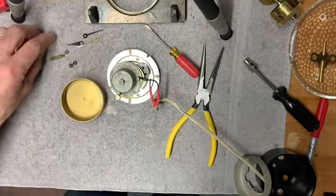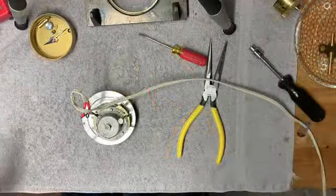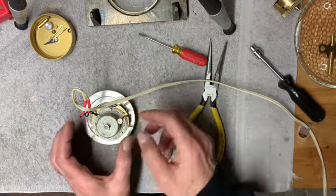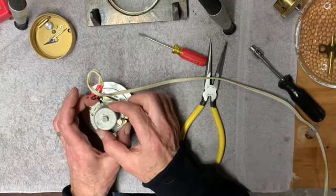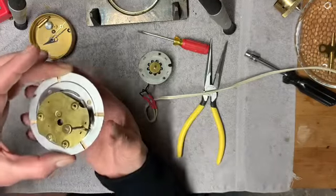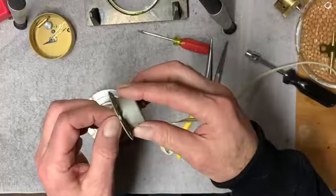Let me gather these pieces up here so nothing gets lost. I've taken a lot of photos and I think I know the positioning of the gears. It also looks as if I can hold down this brass plate — I should be able to remove the motor without disturbing anything underneath it. Let's try that. This plate looks like it's going to lift right up from over the gears, so let me take a closer look before trying to do it. I don't want to have things fall apart, and then I'll be able to check more closely to see why this motor is not working.